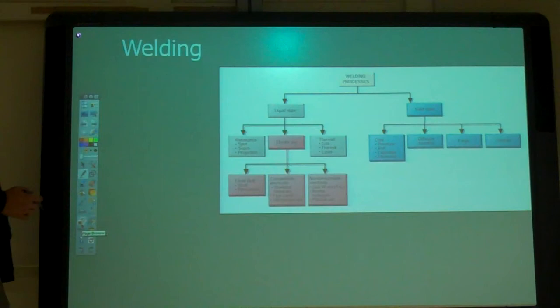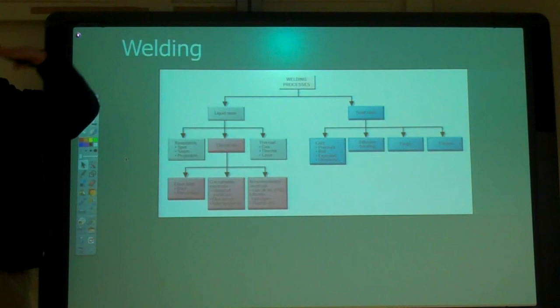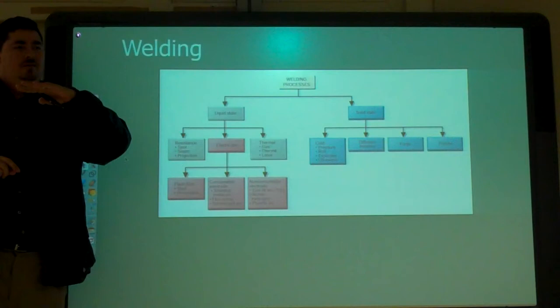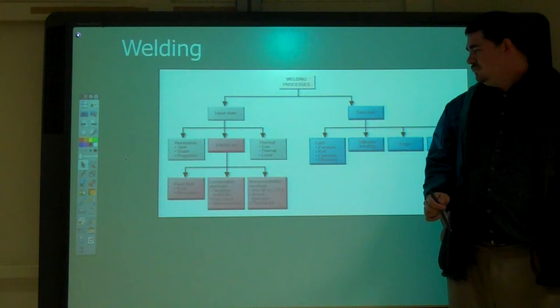And then what was the projection weld? I like that one. They put it on top of the thing and put it together and did the whole thing at once. So instead of just two sheets of metal, you've got a piece of sheet metal and then something that's a lot bigger that it welds down into the sheet metal. It's like the hubs on a hot water heater. So you can join a big piece down into it. You see the heat come from the bottom? From the bottom. Yeah, okay.